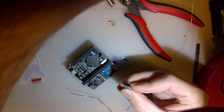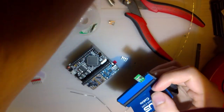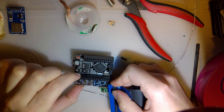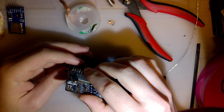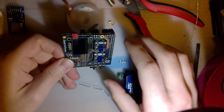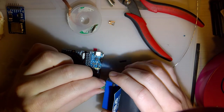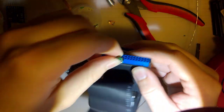I'm going to take the pins off this one too. Because I don't want to use the bent pins. Or, wait, let's plan this out first. That's crooked and that's going to bother the shit out of me. Okay. I don't know why I put the labels on this side, that was dumb. So, middle, of course, is the ground pin. Left one, the one close to the edge, is the input. Which means that needs to go like that. So yeah, I do want to remove these pins, because they're backwards.